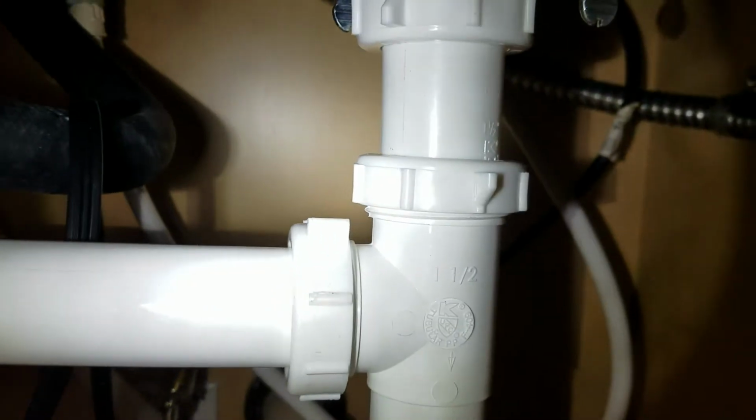It's now new. It's identical to what was in there, but it's a new product, so the inside is whistling clean. What we did do is tubular P-trap and a little tubular extension right here. So there is no leaking in here to the best of our ability. We did run water for a little bit.